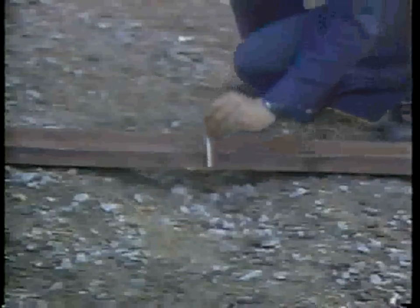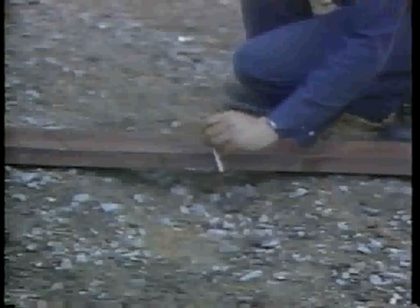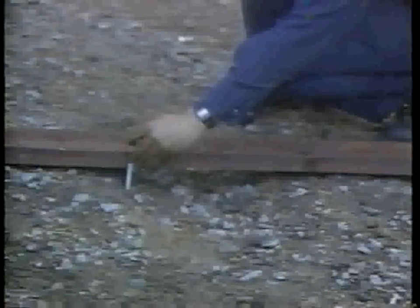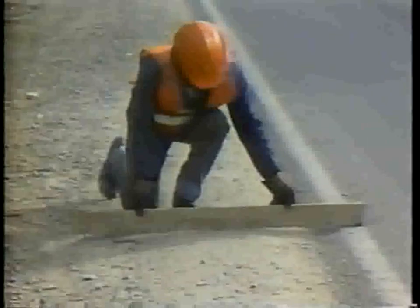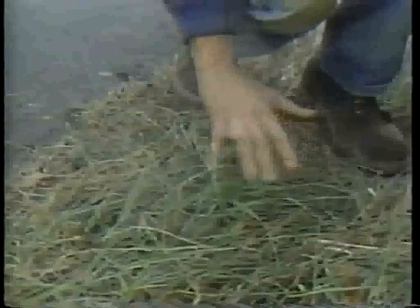Repair road shoulders when their surfaces start showing ruts, or when rough surfaces with ridges over 3 centimeters deep develop. When the shoulder slope is too flat to provide good drainage. When the shoulder has eroded alongside the pavement, causing the pavement edge to break. Or when earth and grass covers the shoulder surface above the pavement edge.